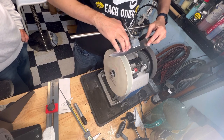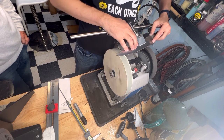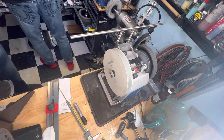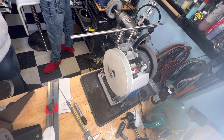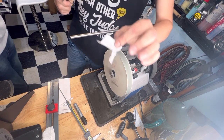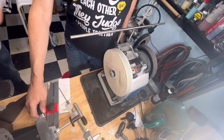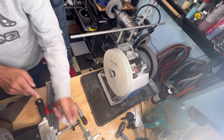If you want to have a real shiny edge, you go in the same angle that you grind, and then you move up your toolbar a little bit to the burr. So you grind, I always say grind. Sharpen. Yes. You polish, at the beginning you polish with the 14,000, and this is sharp. Yes, it is. And it's way more complicated to cut cigarette paper this way than the long way.